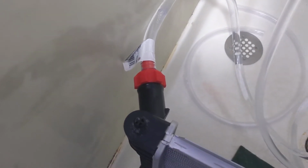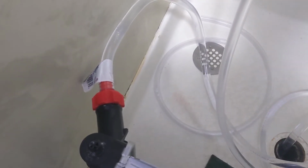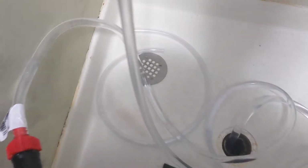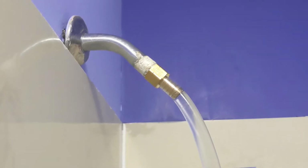Because it did just slide in really easily, and I was worried that super glue wouldn't be enough to seal it. But it turns out I was wrong, and all it took was some super glue on the inside, and then I dribbled some around the outside to seal the outside edge, and that was fine. So that adapted the 30 millimeter inner diameter to a 5/8 inch barb, and then I bought some 5/8 inch barb Tygon and hooked it up.